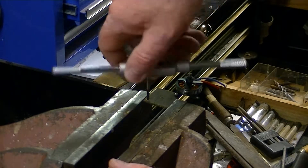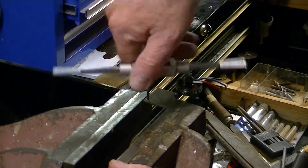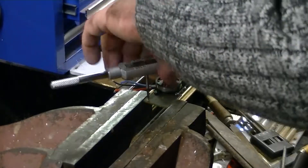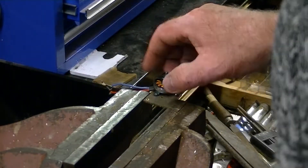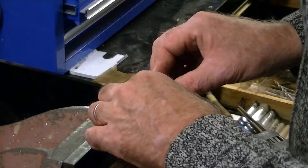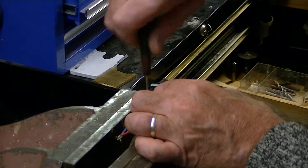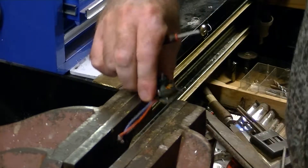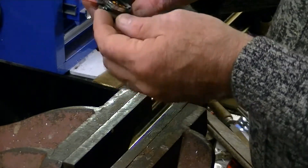I have now drilled and tapped one side, and I've put this in the pedestal drill and lined this up very carefully so that I can screw this onto the plate. As I drilled this, the shaft was clicking into this little central piece here. I had to cut these screws down to make them fit, but what we've got now is a very nice base for this to connect to, and that is lined up. So now we go to stage two.